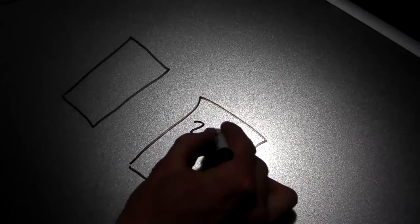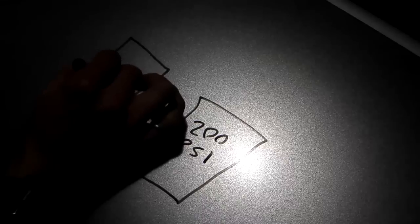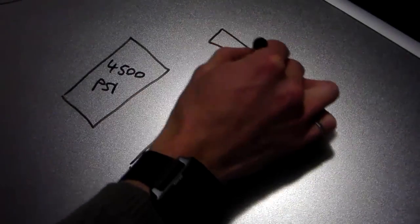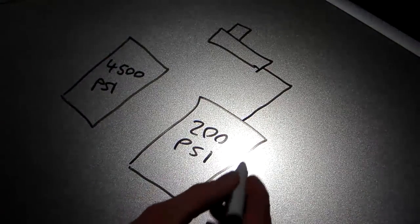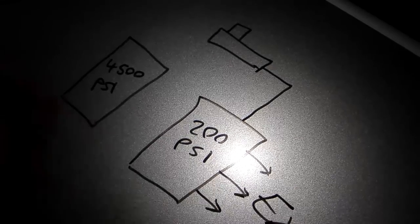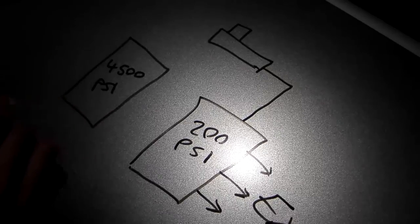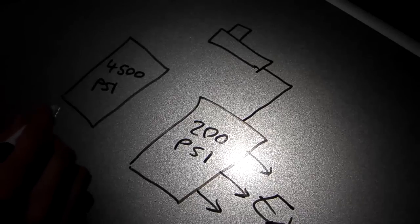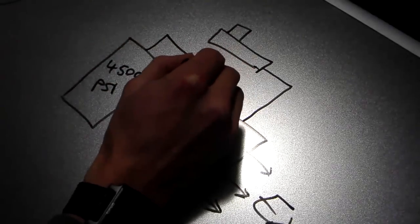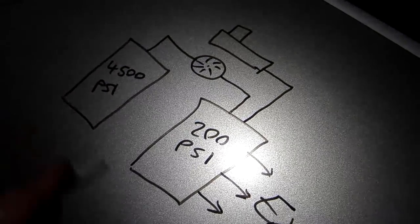Alright, so I'm just going to try and sketch out my idea for the air system schematic for the exoskeleton. My plan is to have two air tanks on the exo. One will be the main tank, held at 200 psi. But then there will also be a scuba diving tank held at 4500 psi. The air compressor I just bought will fill up the 200 psi air tank, and then all the cylinders off of that tank are powered from there. The 4500 psi air tank will have to be charged before using the exoskeleton, because the air compressor for that is very big. But we can take that 4500 psi and have a little pressure regulator to drop it down to 200 psi, so this allows the system to work in parallel.